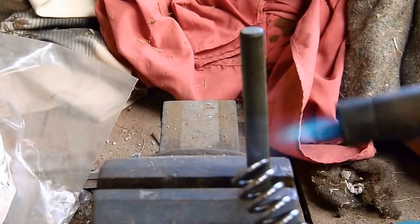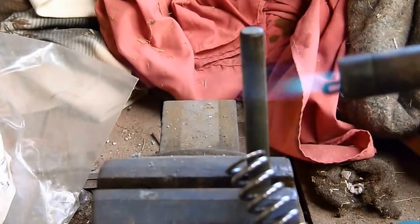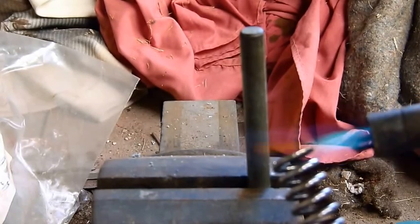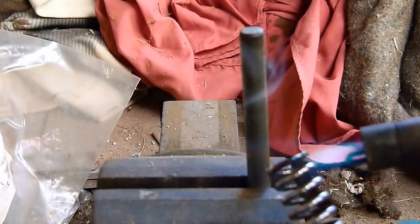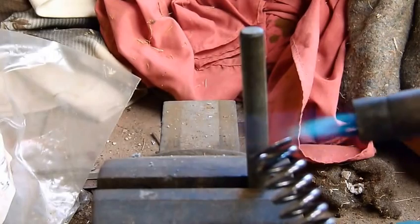As you can see as I do it the colour changes. What we're after is just warming up the very bottom part of the spring until it glows red. The thinnest part, which gets hottest quicker, is now a dark blue colour. The rest of it just begins to get to a blue colour.